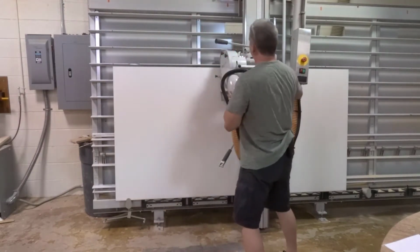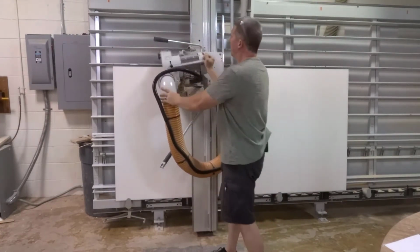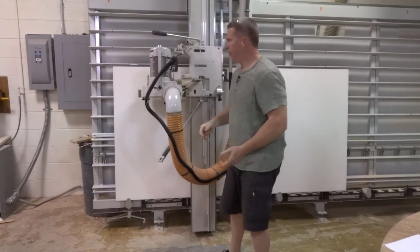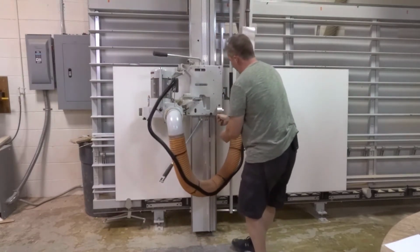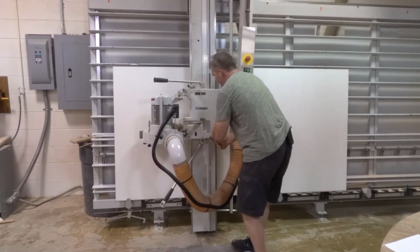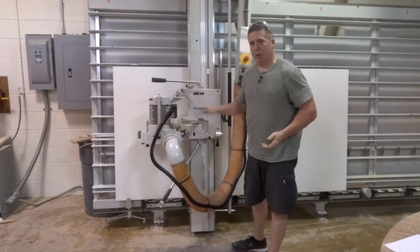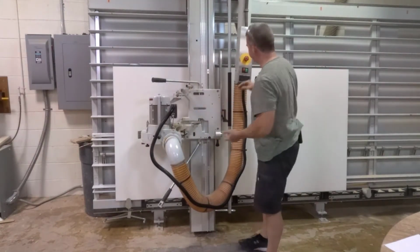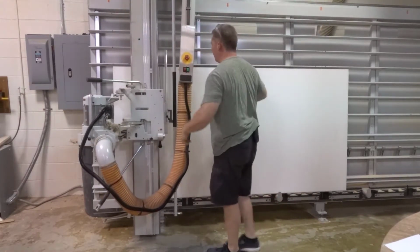So to do that, this is still sliding because I'm going to need to be cutting horizontally this way. Just move my saw blade back. And now we're going to use the next stop down here. We just lower it down, push that little knob, that rod. That stops my saw. Lock it into place nice and tight. We don't want it to move in the middle of the cut. Again, we come all the way to the end. We're going to press in and go across.